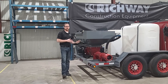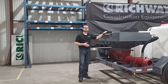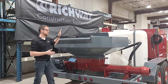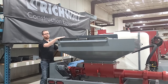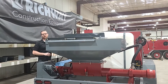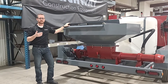We want to make sure we're keeping that material out of this pump, and we do so by adding a screen on top of the hopper. Inevitably, at the end of your job or the end of the day, you're going to have some material build up on top of this screen. So one of the features we've added is a spring assist to this whole screen assembly, so that one or two people can easily just lift this up and dump all the aggregate or debris off the hopper on the pump. We've added that to make it just an easy and convenient feature for you to get the machine cleaned out.